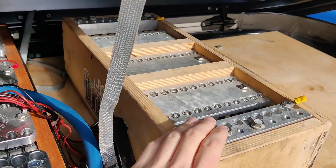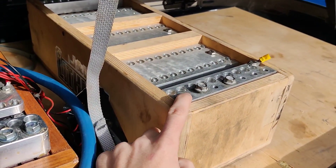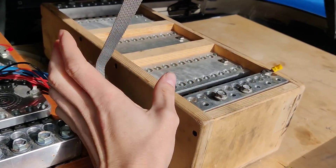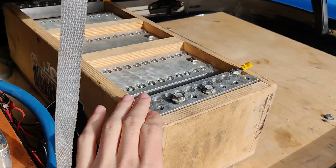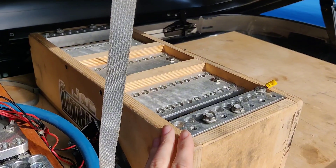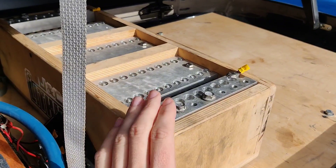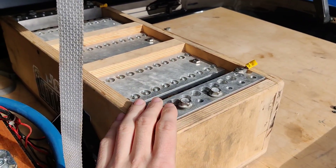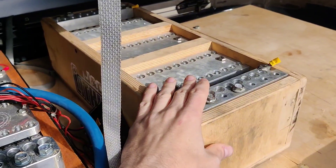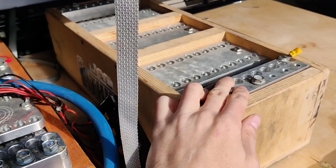The Proto cells can handle the most amount of power. This is a 60 amp hour Proto and it can handle probably about 25,000 watts, maybe 30,000 on a burst. For music, I would say about 15 to 20,000 watts would be okay. Again, it depends on your charging power and your voltage.